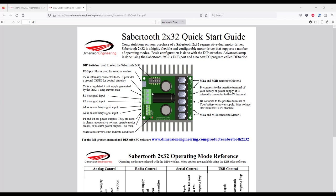On the left side, on the upper terminal block, we have two pins for power output. Some people mistakenly think that this is a power input — actually, it is a power output suitable for powering the remote control receiver. Next, we have two signal inputs on which we connect two channels from the remote control receiver. These two channels will actually drive the motors.